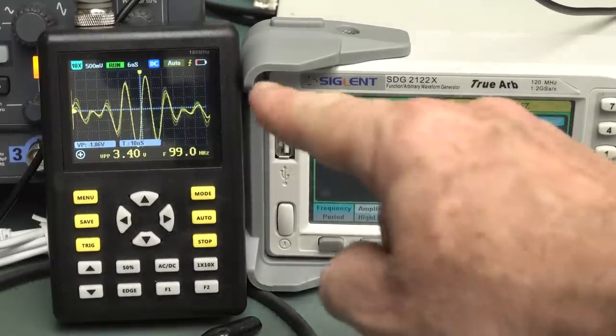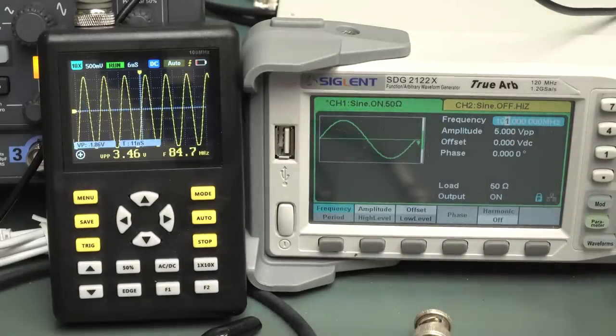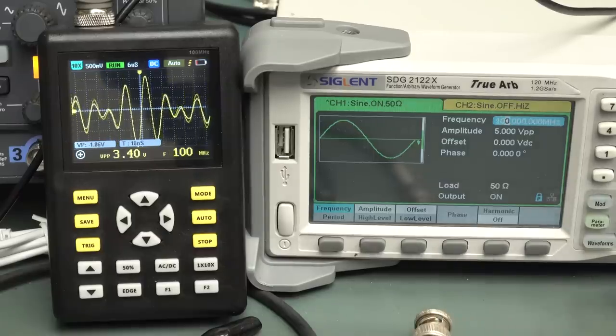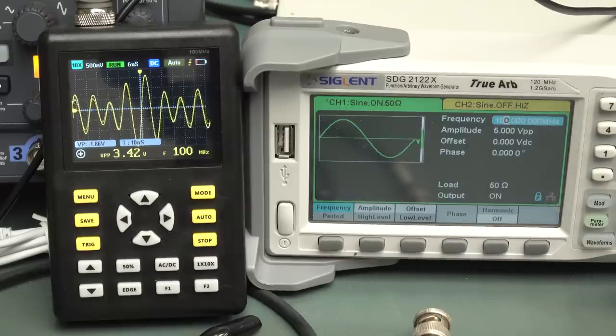Look, this only happens at 100 megahertz. Watch this. Go to 101, doesn't happen. Go to 99, doesn't happen. This thing has a ridiculous software sampling beat problem. I'm struggling to find the correct terminology for this, but yeah, this thing is completely coming to a gutser trying to sample at these high sample rates, and it's just going nuts.